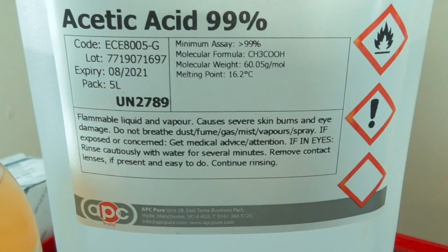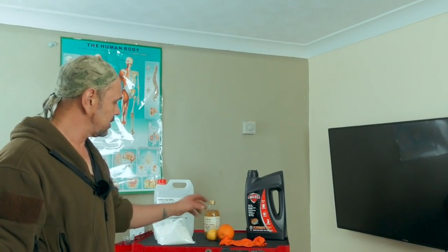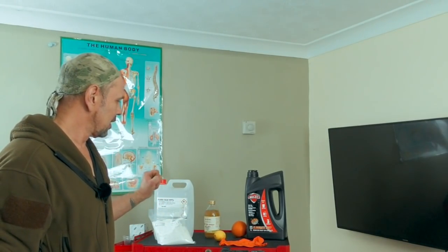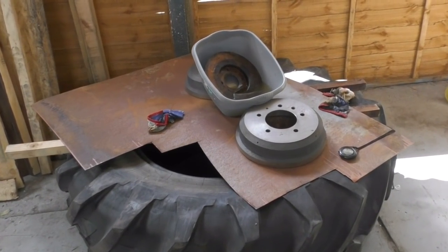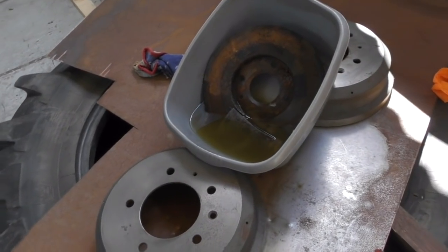I use 99% acetic acid only for cleaning kettles, watered down. Citric acid is a little bit better — you could wipe something with a lemon and it would work. The MC51 eliminates rust by soaking, wiping or spraying. I've got a sample going outside and there are children running about — I wouldn't be doing it if there was a chance of those children getting hurt. When you're rust busting, you want to think about the best possible way for the environment you're in.